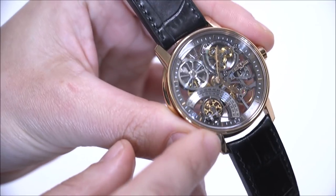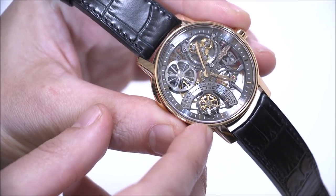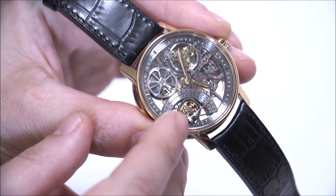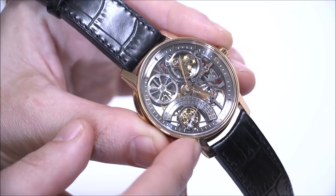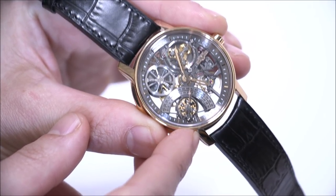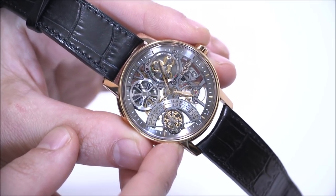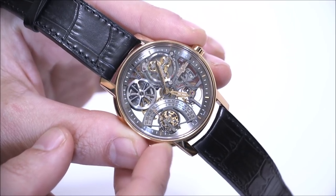There's a neat feature in the seconds hand. If you look at it closely, it looks like a retrograde counter, but look what's happening: rather than a traditional retrograde hand where the hand moves and then jumps back to the starting position, this hand moves backwards and forwards. On top of that, the hand actually extends — there's an upper and a lower scale for indicating the seconds. One is zero to thirty, and one is thirty-one to sixty, and thirty-one to sixty is on the way back.